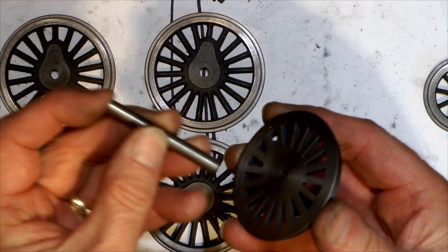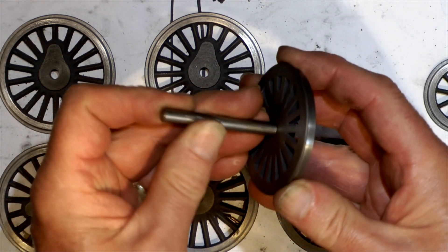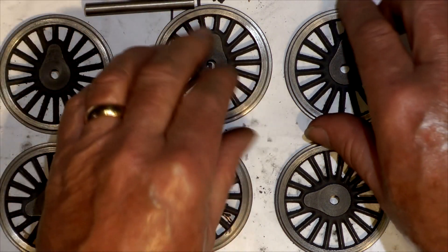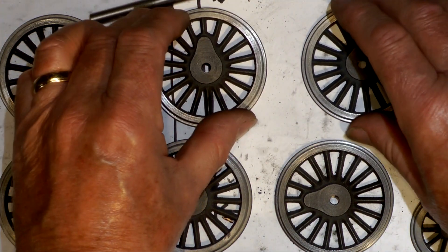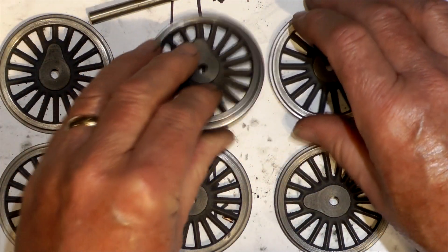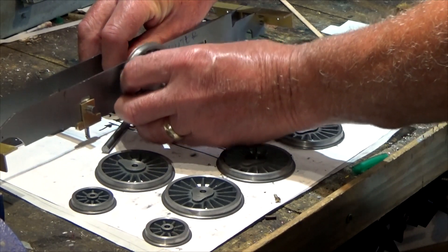My method is I use a pin and a screw in here and that locks it — and that's quartered. Other people rely on a push fit and use a locking glue to hold it, but for me that doesn't seem to work very well. The push fit is fine when you put the wheels on, but you need to take the wheels off to paint, strip down, and reassemble, and this constant on and off starts to work loose. With my pin and screw method it stays fixed.